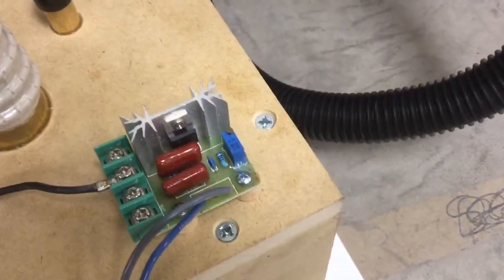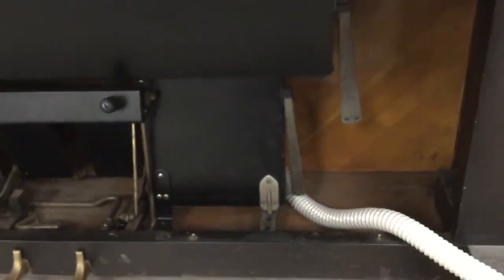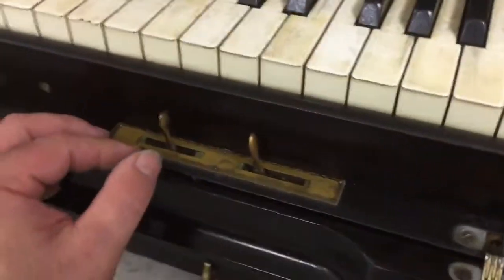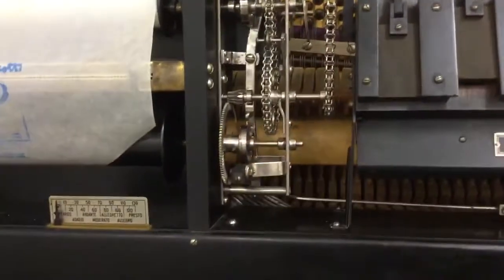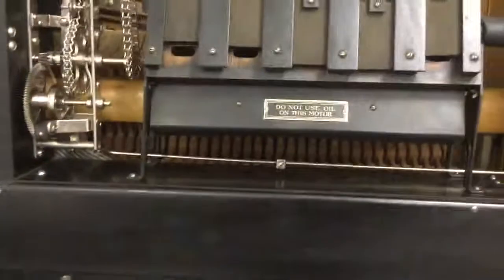I made further adjustments using the trim pot on the speed control unit. This pump is really pretty quiet, and I think it'll produce even less noise once it's mounted inside the piano cabinet. When the bottom board is in place there's not much to see other than the sustain pneumatic, and even then it won't be too loud. With the tempo control all the way low, set it to play and turn on the pump — the bellow just closes. I've got a little adjusting to do on my air motor because it's not pausing like it should.